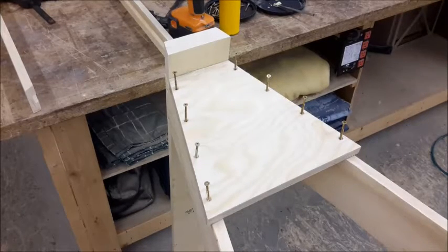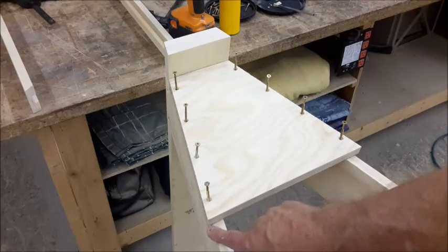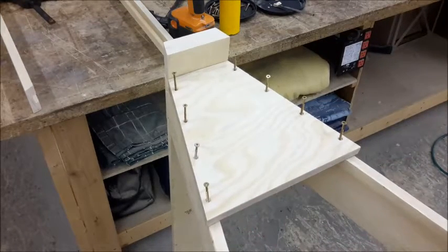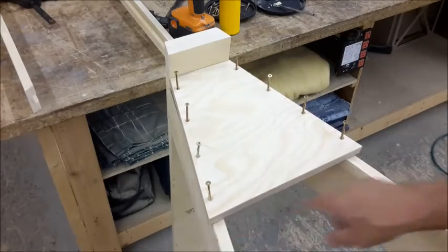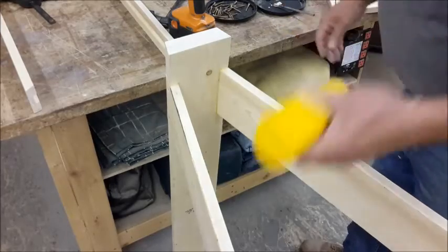Okay, now it's time for some assembly, and assuming that all of your equipment is accurately set up and the angles that you cut are consistent, then you can put a lot of faith in this gusset, where you can see clearly that the leg is short of coming to the point, and all angles are consistent, meaning 15 degrees up here is 15 degrees down here. That might vary because the legs are bowed a little bit, but that's easily overcome. So I put the gusset up here and made two pencil marks to show where to stop the glue. So we'll put that on there.